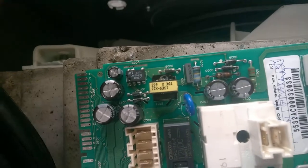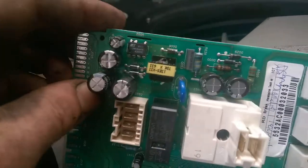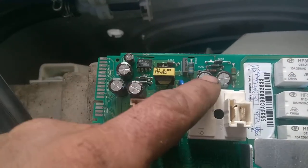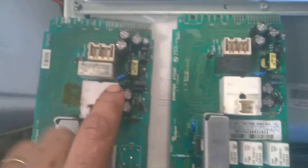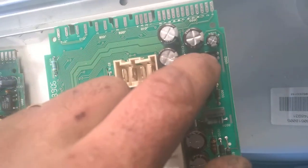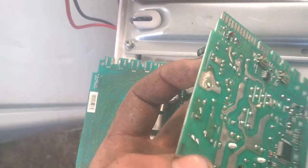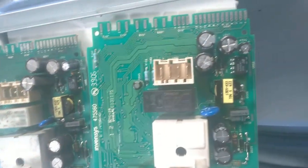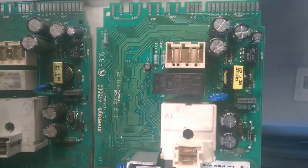The value of this resistor is really not critical. What I'm going to do is go to my junk stash, get another faulty control module with a different fault, and replace the IC and the component — then we're good to go. Here we have our donor board and the board we are going to repair. If you don't own any fancy soldering equipment like a soldering pump and you don't want to risk damaging anything, you can use a very sharp knife and cut the pins right next to the chip, leaving the legs standing out. Then you cut the new replacement next to the board and you weld leg to leg. I'm going to do that just to show you the result. It's not pretty, it's not fancy, but it will work fine.